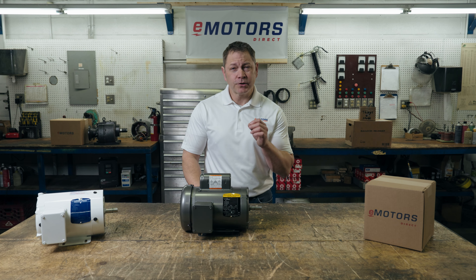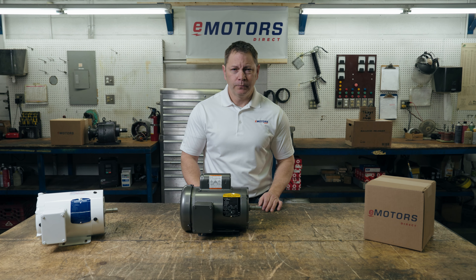The key here is occasional overload, not continuous overload. If your motor has a service factor of 1, you can run your motor to 100% load. However, motors are most efficient when they run at only about 75% of the rated load. The service factor is there to make room for oversights in the predicted horsepower needed, handling the occasional overload.